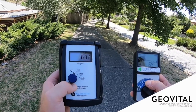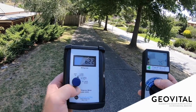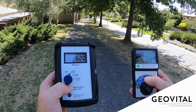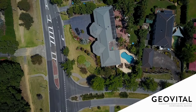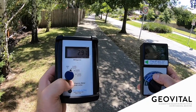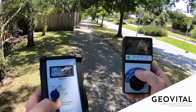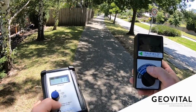So it's reading a bit higher than the more professional meter, but that's not too bad given this is a layperson's instrument. The news at this particular spot is the same — the levels are way too high. Now in line with the very front of the house, we've got about 2.9 milligauss on the UHS-II, and about 3.4 to 3.5 on the TF-II.